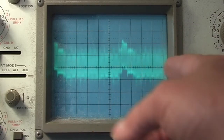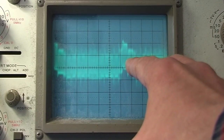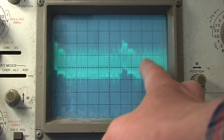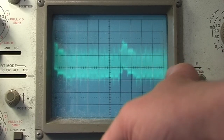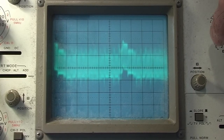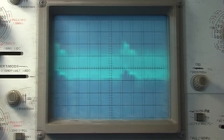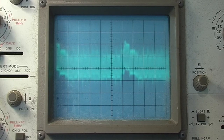So, these are lines, that's a line, that's a line. This is the sync here, and you've got the porch, and then that's the signal, the video part. It's upside down in terms of what you would have eventually. That gets filtered to form the actual signal, and obviously inverted. But the problem's got to be somewhere between the heads and there, because it's in FM. You can tell by the inversion that's going on, that's an FM problem, because after that, it's just low pass filtering and stuff.